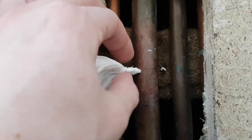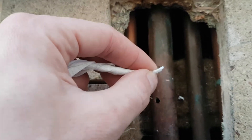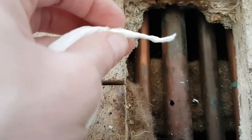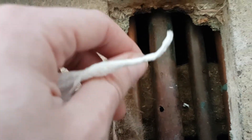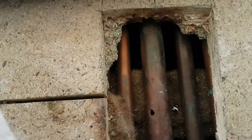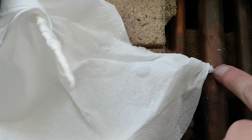This will give you a gauge of how much water is left in the pipe — you can roughly work out the height. As soon as it starts to pretty much empty, push the towel all the way through making sure it's contacting the bottom of the pipe, then leave the kitchen towel hanging out. It will act as a wick — the water will come up and absorb into the towel. This is best left overnight, so it's not ideal for an emergency repair, but if you have the luxury of time, I've left it for a couple of days and it comes back bone dry.